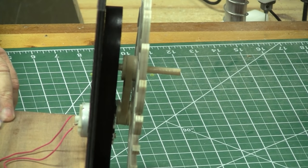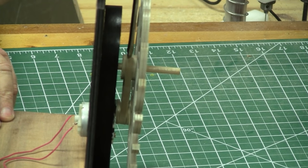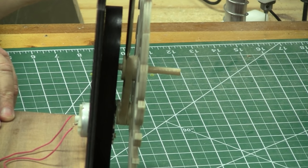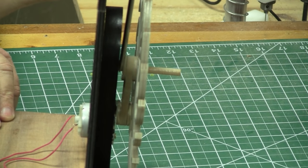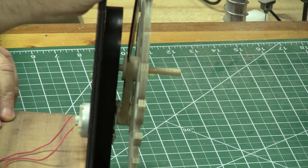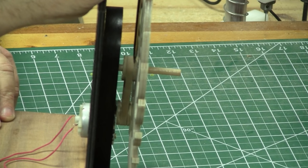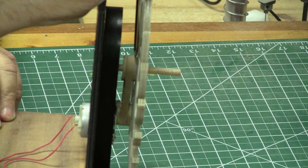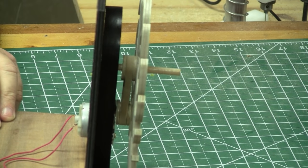This is the side view with the rotating gear installed. If you look down between the piece of black and the drive gear, this is the upper wheel that the drive belt turns on, and as you go down, you can see the bottom one. One thing that happened is when I made these pieces, I didn't get the flanges on the side of the wheels tall enough, and occasionally as it's running, the belt will ride up on top of the flange and get a little bit off-centered — I've even had it stop a couple of times. So in the pattern, I'm going to make those flanges a little larger so they trap the belt in there better.